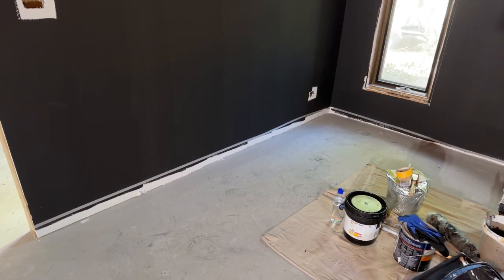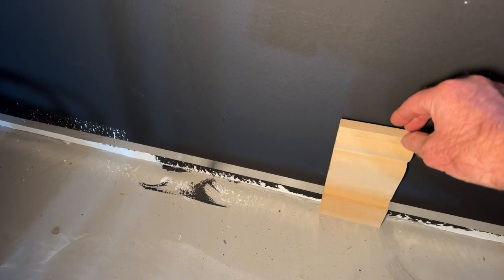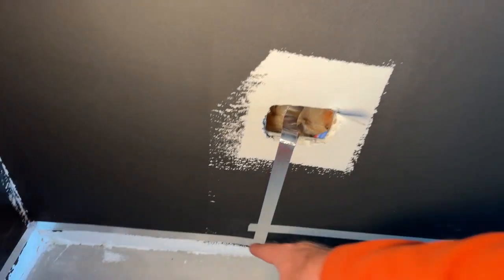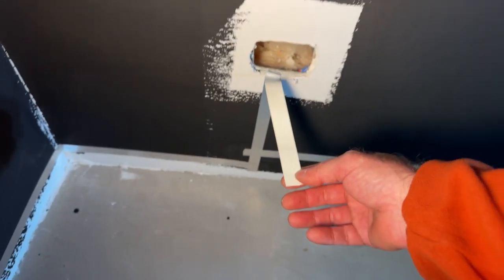The tape follows the wall and just goes around the corner — it doesn't matter if it goes up and down a little because the skirting boards haven't been put on yet, which is convenient. Those skirting boards will go in later so there's plenty of space for the tape. Here we've made a tape going up into the cavity of the power point — this could have just continued instead of making a join, but the skirting board will cover all that. You normally put the tape a little bit off-center, and I'd recommend a good 30 centimeters — a foot or a little longer — with the backing left on, into the cavity of the power point so the electrician can connect to it later.